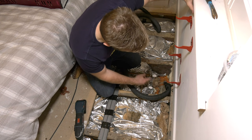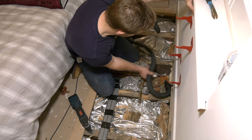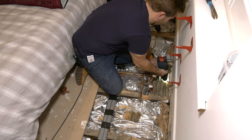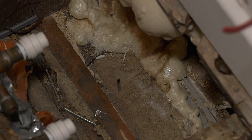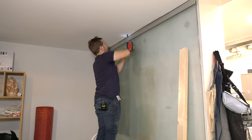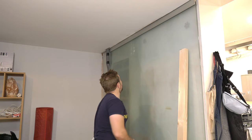So now I know where that's coming out, I'm just gonna trim out some of this lath plaster, clear it all up in here with my multi-tool. Now we can see exactly where our screw's coming through. We've cleared this cavity out. We can now go back downstairs, make these holes a little bit bigger. We know we're quite safe to do that from underneath now. Then we can work downstairs to get our radiator and everything measured out. Right, there we go - two holes drilled.